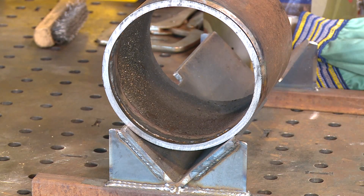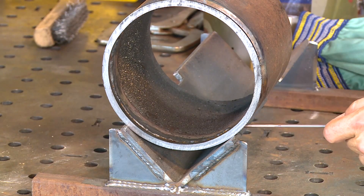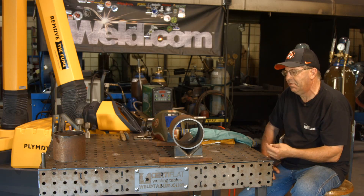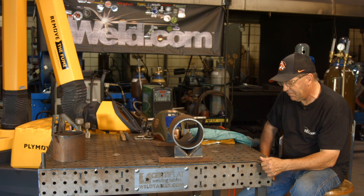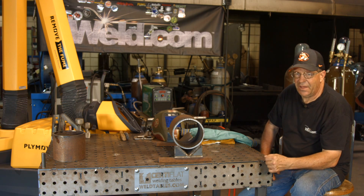Fat wire, it had a big old kind of wavy cut that still shoots through here, but it's tight down here — it won't go through. So I opted to open it up. There are a lot of options when you're doing stuff like this. If I was out in the field running on a dry rig off a generator or something, I would probably have skinnied that fit up a little bit, set my amperage at about 80 or 85, and ran it that way.